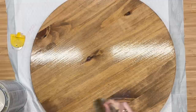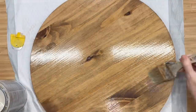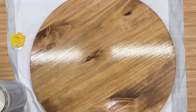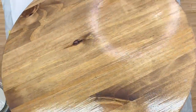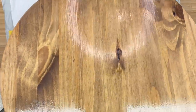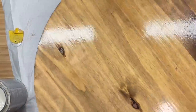I do two coats on the back and two coats on the front. If your wood round is going to be directly in the elements — meaning you don't have an overhang on your porch — then make sure you do a third coat on the front. Also make sure you get the sides of your wood rounds. If any drips dry on the side, there are going to be cloudy little drip balls hanging from there and we don't want drip balls.